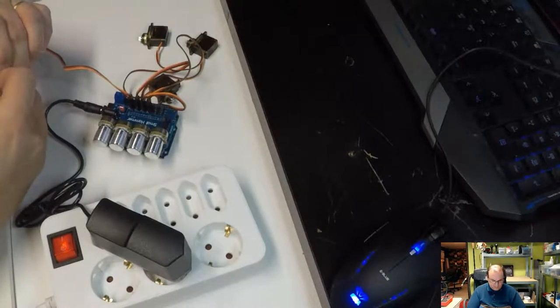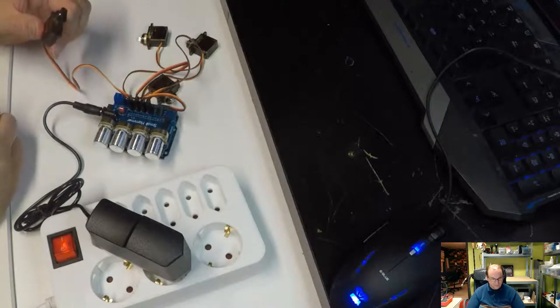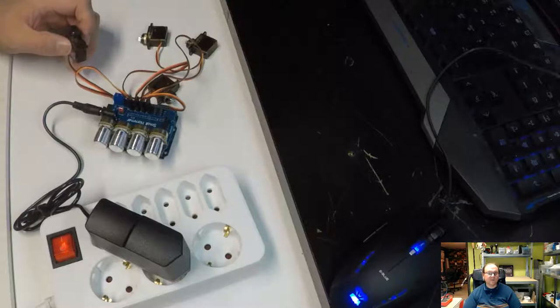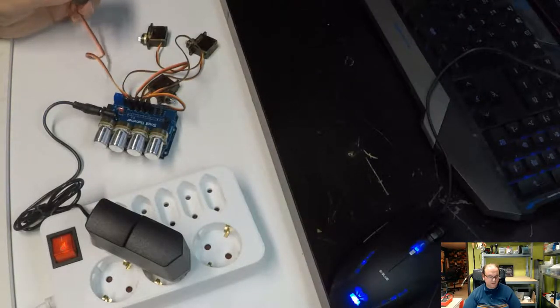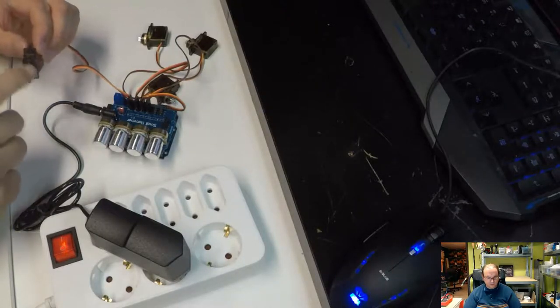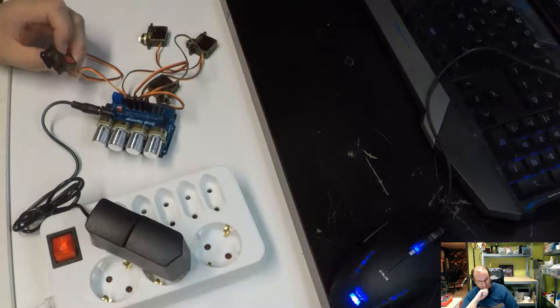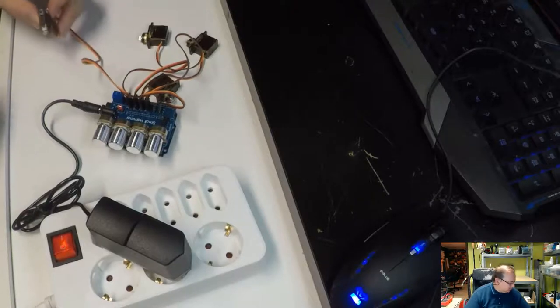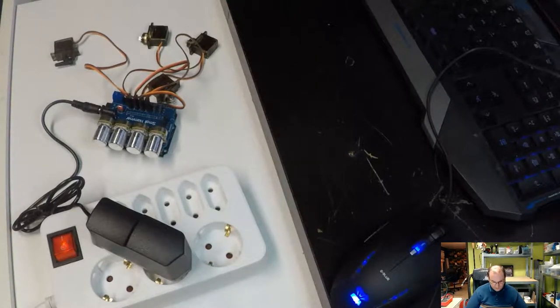I won't put these arms on permanently either. But they did say that we rotate the steering gear to the middle position. It might be necessary when we're doing the next install that the servos are adjusted so that when they're actually put into place, they have... because these are not rotational servos, so they don't go 360 degrees. So then maybe it's necessary to have them centered. I think I'll just take the small arm out of every package and use that to test each servo.